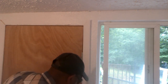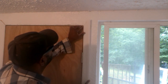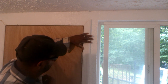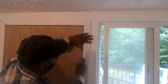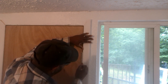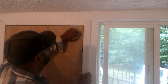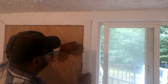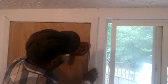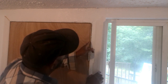Put this trim on the other side of the door — gonna put that right there with the corner on your door. Put that up in there. Now what you might need to do right here at your hinges is mark down and notch it out a little bit, probably by a quarter of an inch, so you can get close to the door right here.